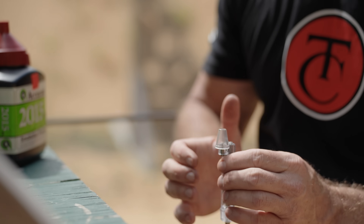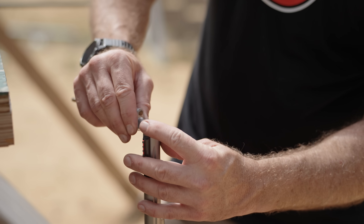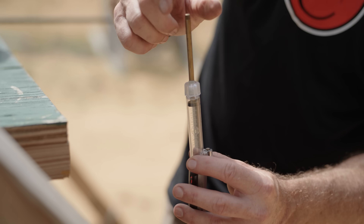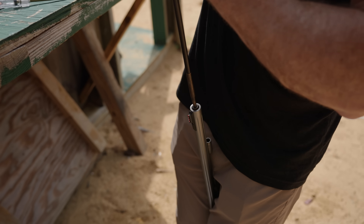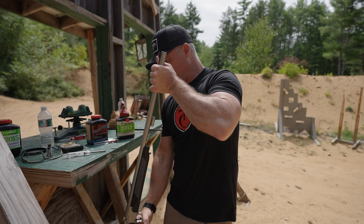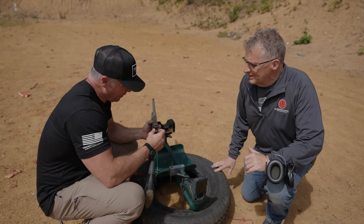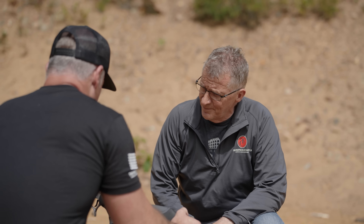I personally have not done this — I've never put smokeless powder in the barrel of an Encore. I have no idea whether it's going to crack the stock, bulge the barrel, or detonate. It could send this into a million pieces or it could be fine. The Encore is built for centerfire rounds — it's tough and strong, but it is not designed for smokeless powder. With smokeless, it's a much faster burn. I would anticipate if we're going to have any problems, it'll be in the breech area, which could cause the barrel to fail and possibly the frame.